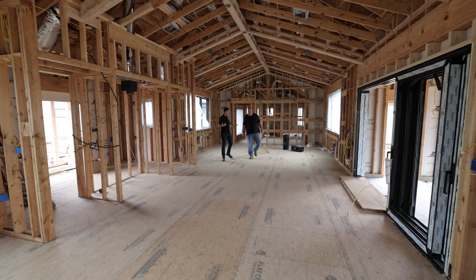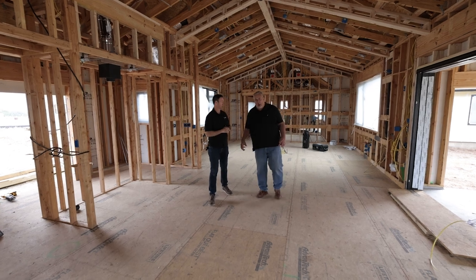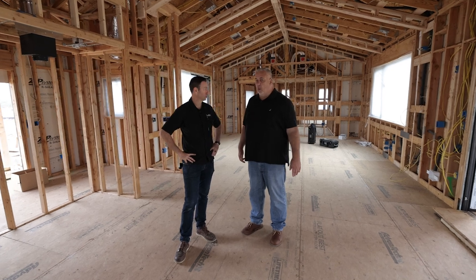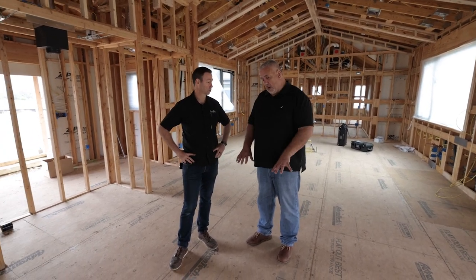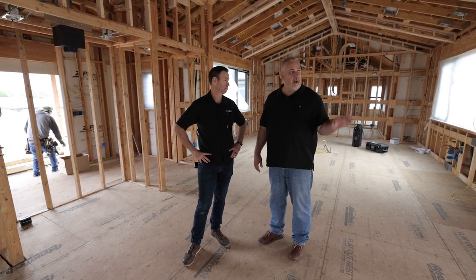It's awesome. You're in the mechanical phase. Looks like the insulation contractor is about to do insulation. What are you doing for insulation on this house? It's a hot roof. We are going to do some spray foam up there. We're doing some blown-in insulation in the wall cavity, we have the Zip R6 system on the outside, and R10 below our feet, so we've maintained continuity in our thermal envelope. So it should be really good out here in the plains of Texas.